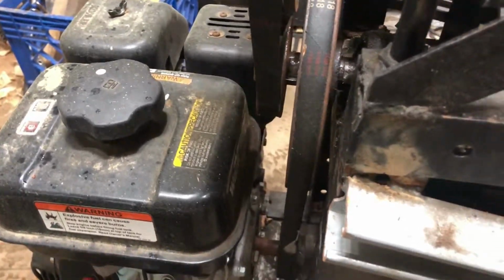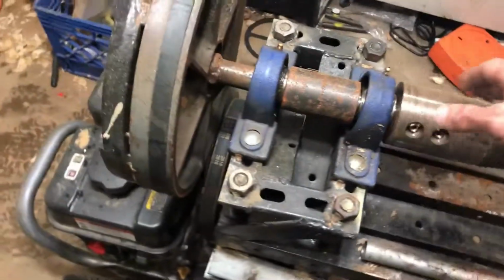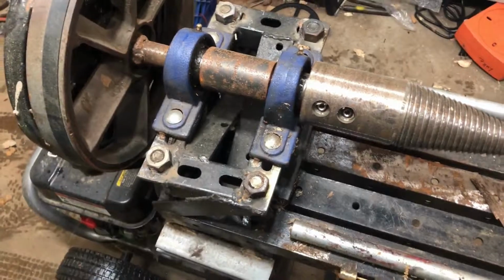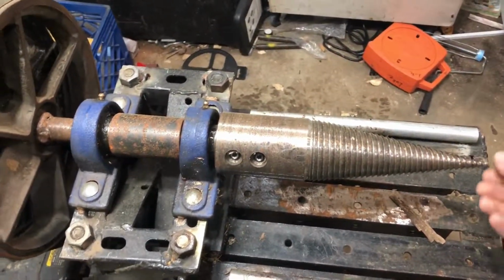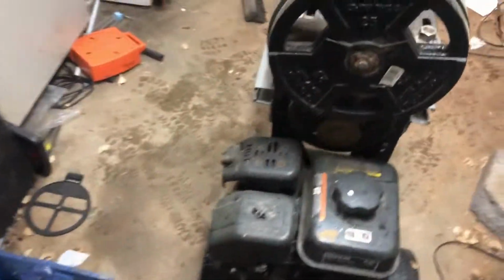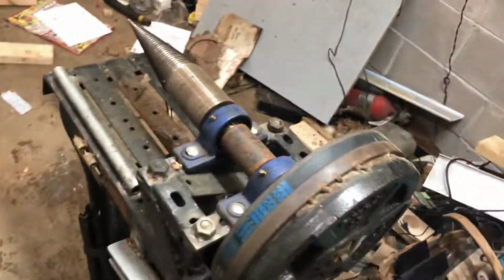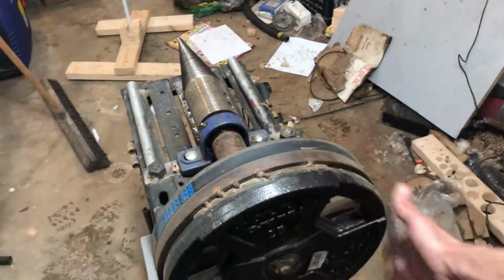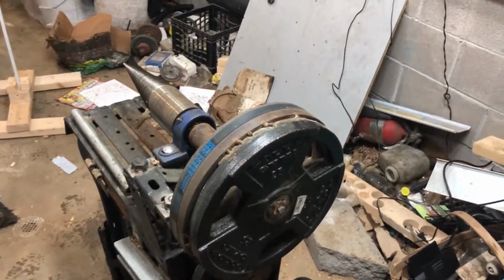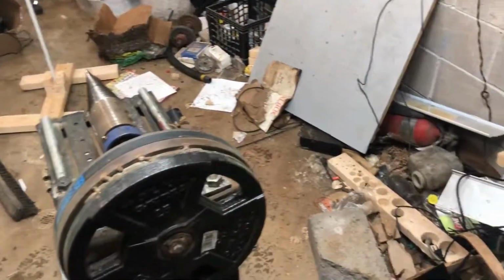This is a gear reduction, and ideally I didn't want a gear reduction. The faster this thing can ultimately turn, the faster you can split a log. So the bigger your motor, honestly, the simpler it gets, because you could have just run one belt from here to your motor. Using one belt, I will say, is very much pushing it. If this was any more horsepower, I would have a double V belt setup.